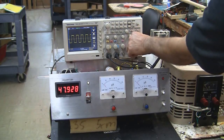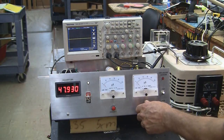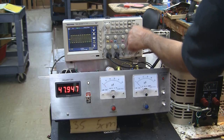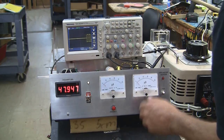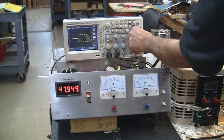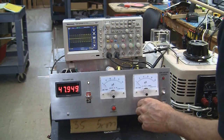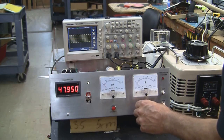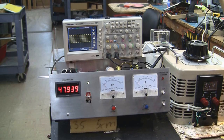The advantage of this is that you may have a load that you cannot get your proper voltage to, and it will overdraw the current rating of the power supply. So you control the current with the duty cycle control and still maintain the high voltage across the load, but at less total power. This is a way to change the power going into the load without changing the voltage — just breaking up the current for one cycle.